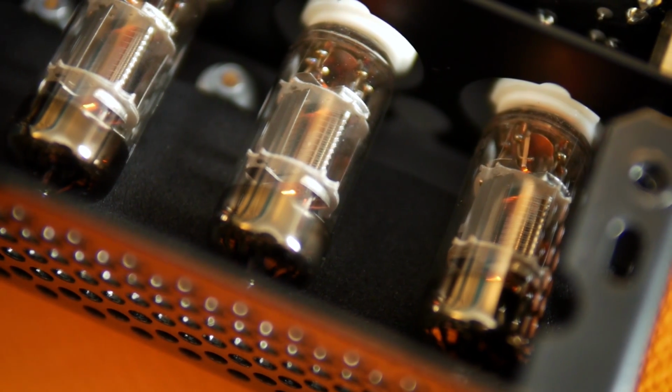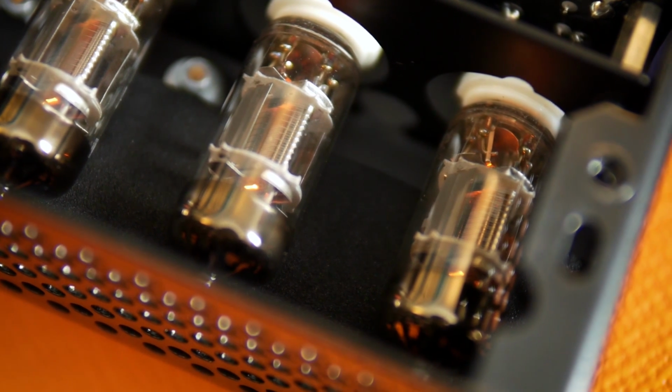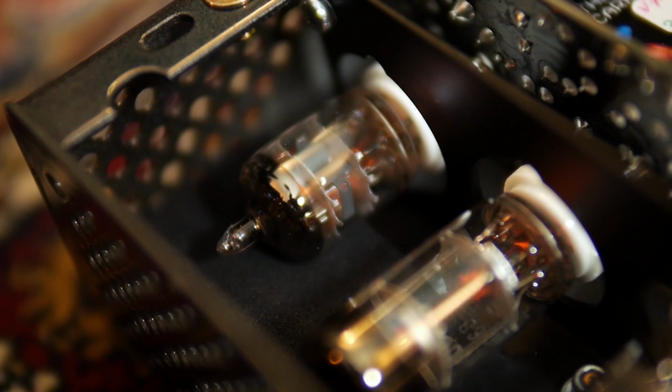Both preamps feature a heavy-duty housing which protects quadruple preamp valves: 3 new old stock CV4014 military-grade pentodes, and a single EC900 triode. A deviation from the norm which showcases the diversity that once was valve technology. These valves are physically smaller than the more common ECC83 or 12AX7s and are supremely robust and reliable, being originally designed for high vibration applications such as military aircraft radios.